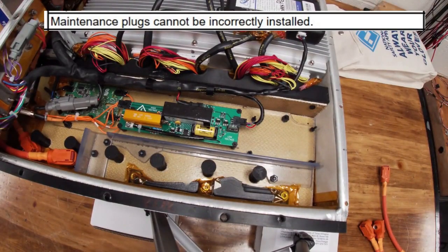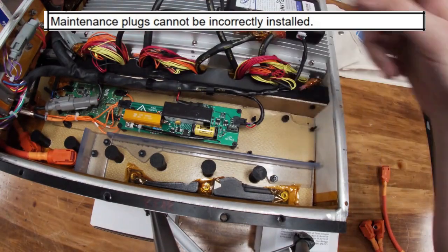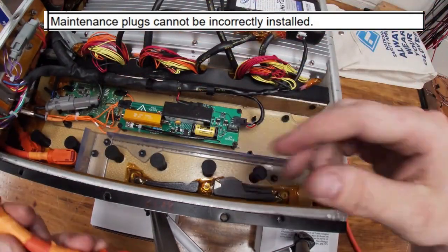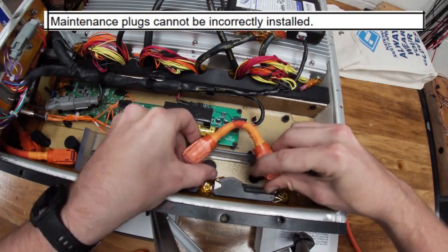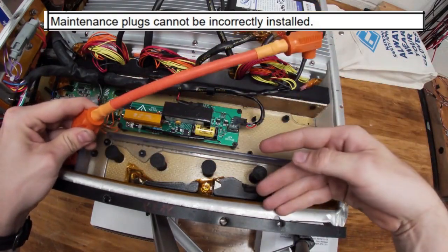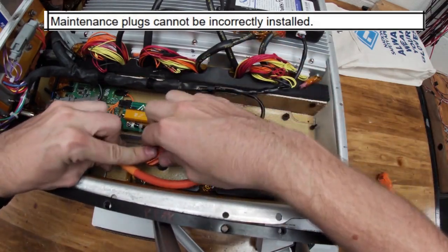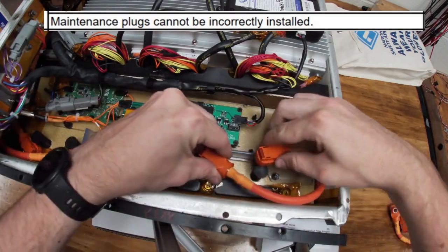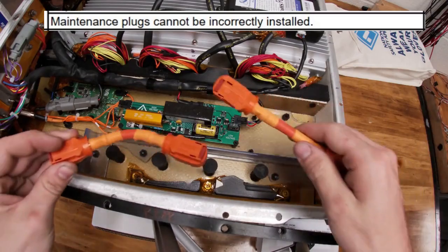For these four pins on the right in the rear, proper installation of the maintenance plugs is maintained by barriers in front, rearwards, and to the left of these four pins. With the main lid off and the service lid installed, we only have these three maintenance plugs — these three segment connections to work with. These two are trimmed short enough that they can only reach across like this, and they are not long enough to bend and be installed incorrectly without intersecting through the barrier, which is of course impossible. If I take this longer wire which goes in the front and does not belong here, it cannot connect between these two without intersecting either the wall of the accumulator or one of the barriers. It still creates such a big loop because of the bend radius that it must go through the barriers to be installed improperly. This fact is maintained regardless of which two pins you try to install it on. Thus, for these four pins, only one possible configuration is possible using the two correctly sized segment connections.